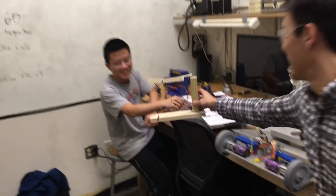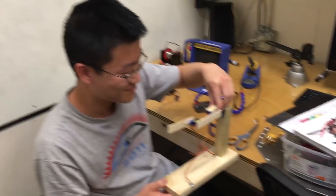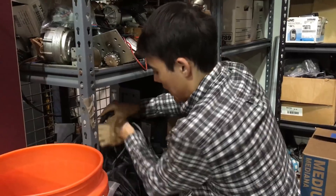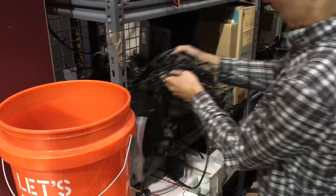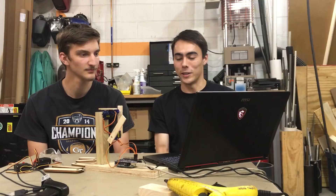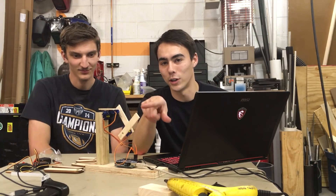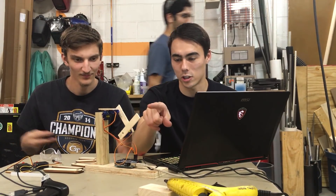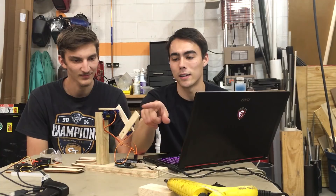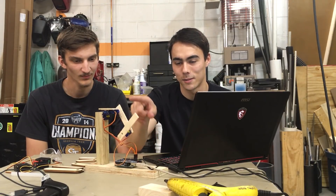Try to move it. What we're doing is called reverse displacement analysis. We put in a 3D XYZ position and then it computes the angles for all the servos. Turns out these servos are so bad that it's supposed to be moving in a straight line, but the servos can't actually maintain position or angle properly, so it's actually not tracing a straight line.